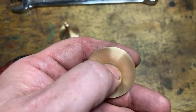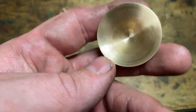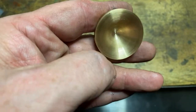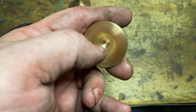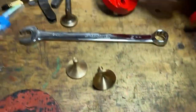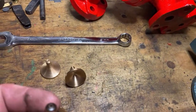These are the valves. They've got a radius in the bottom, which is 1/2 inch, and they're 1/2 inch deep. So I've put a ball nose cutter into there, the right depth, and then I plotted out this radius the same as I did the front, and just in 0.2mm steps. So just cut in as we went right out to the outside and then cleaned it up with a graver. I think they're pretty good. I think they're really nice actually. This is the original, which you can see is pretty worn. No label on it yet, but we could do that. I reckon I could have that done by the end of the video if we needed to.